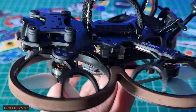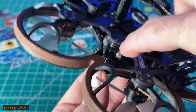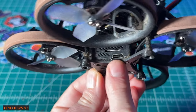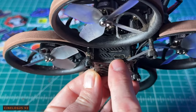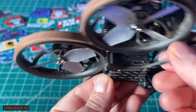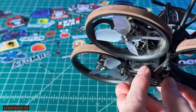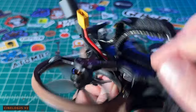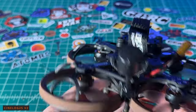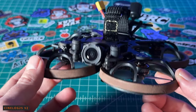As far as access goes on this version, it's nice. The TBS Crossfire Nano is placed right on the side, so I was able to get to it with my bamboo skewer and bind it up quickly to my TBS Crossfire module. On the bottom, the O3 is slightly sticking out, and I have full access to the USB-C port for registering it. You need a DJI account to register this quad and bind it to your goggles for first use. I also recommend updating the firmware. There's SD card access just above the USB-C port, plus easy access to the flight controller — the Taker F4. You only need a USB-C data cable to access both the VTX and the flight controller.